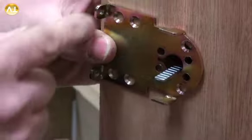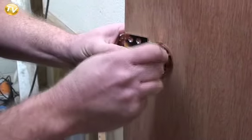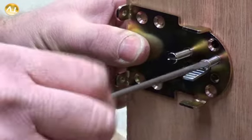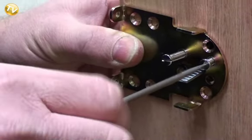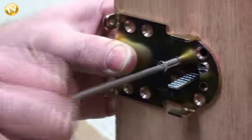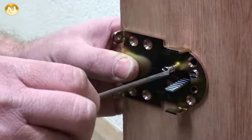Get the plate and hold it 3mm from the front face — we can always adjust this once we've done the screws up. This can be a little bit fiddly. Place the screws through and you'll soon pick up the holes they need to go into. Hold it nice and square, then get the flat headed screwdriver and tighten the screws into the barrel. If fitting onto a thinner door you might have to cut these screws down. Tighten them up slightly — don't over-tighten because you may need to make a few little adjustments to the plate.